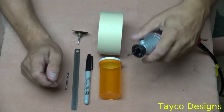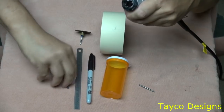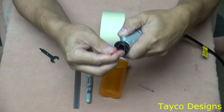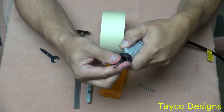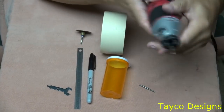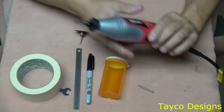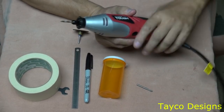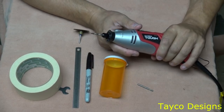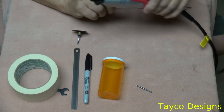Okay, let me loosen this and take this grinding bit out and put the drill bit in here. Tighten it up — hand tighten first and come back with a wrench and tighten it up. Now I just made a huge mistake — don't do what I just did. I neglected to unplug this Dremel from the outlet. So it's always a good idea to unplug your tools before you change bits. I made a huge mistake there and I'm willing to admit that.